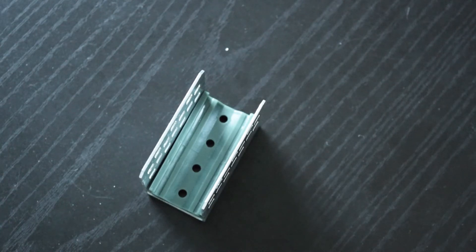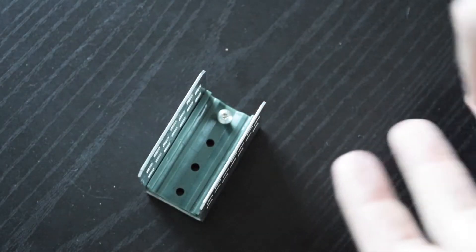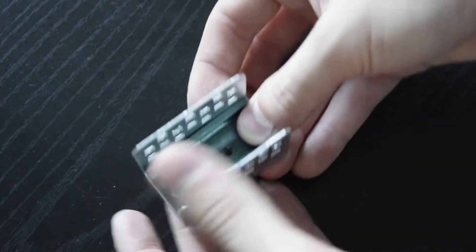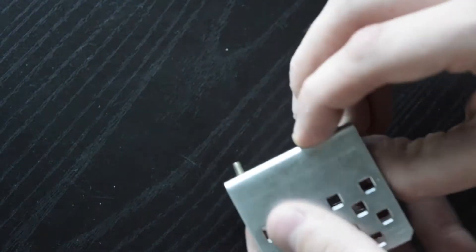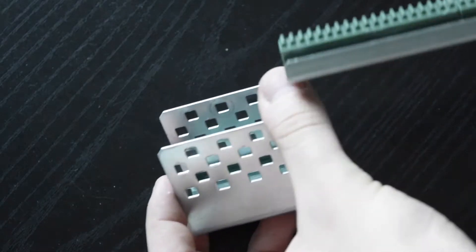You may have thought, hey I just want to have something move straight but I can't use pneumatics, or I need more reach, so I'll just use these linear slides. Well I thought this, but when I went to go assemble it I realized that the screws that attach the gear strips to the slides interfere with the screws needed to attach the slide holders to your structure.